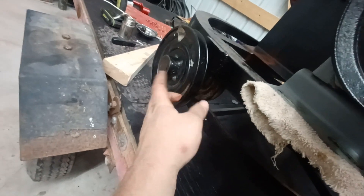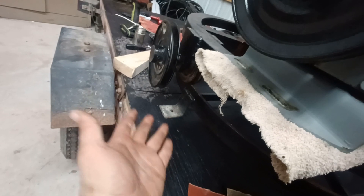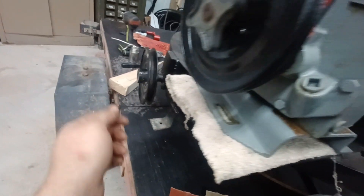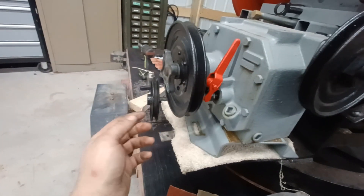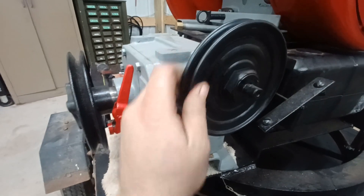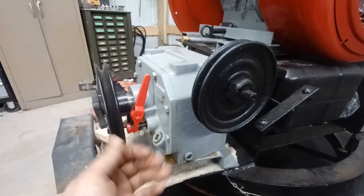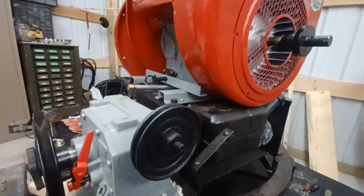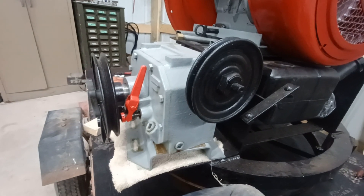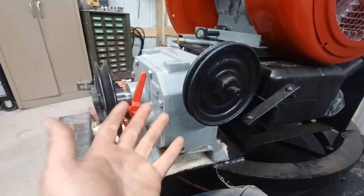You can slip this and even reduce the pulley size. There's actually more of a limitation on how big you can make the pulley — making it slower is harder; it's actually easier to go even faster. Maybe we'll do that for fun sometime and get a 20 RPM siren. Anyway, that's the basics — I just wanted to show how the rotator works on a mobile director. I think the electric ones are extremely similar; I'm not sure if they went to a single speed or all had this two-speed setup like my particular one does.